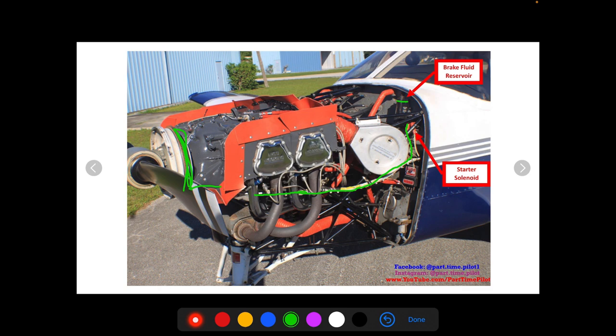That's a general overview of the aircraft engine systems and parts you'll want to check before every flight. Look for fraying or damage in wires, bad connections, oil leaks, and fuel leaks along connection points. Make sure your engine is good to go before flight. If you have questions, follow us on Instagram at part.time.pilot or Facebook at part.time.pilot1. Please subscribe on YouTube to enjoy our videos and help you study for upcoming exams and check rides. Thanks for watching!